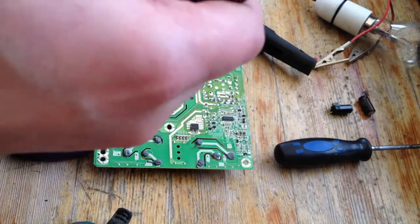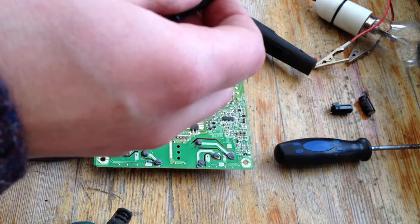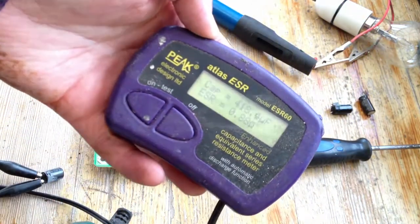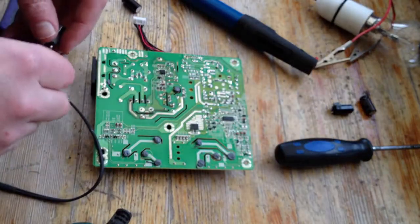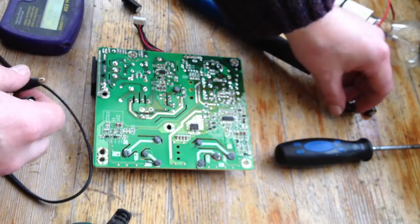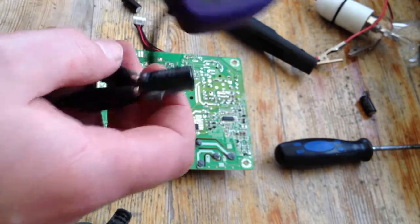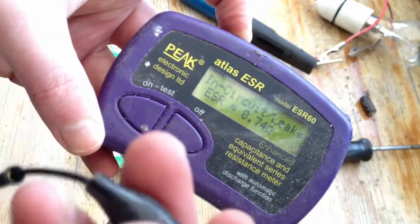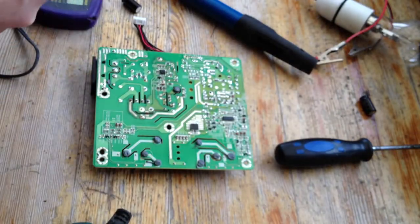Although I know these capacitors are already damaged, you can verify it with an ESR meter, which measures capacitance but also equivalent series resistance, which goes high on failed electrolytic capacitors. Here we see 417 microfarads and 0.8 ohms — we'd be expecting 680 microfarads and 0.1 ohms or lower ESR. On the second capacitor, which is meant to be 1000 microfarads, it's actually coming up as leaky, and I'd say that was the main reason why the monitor would not turn on.